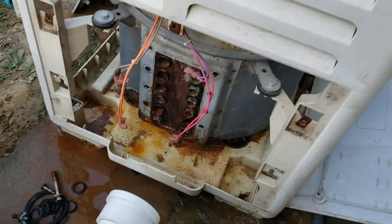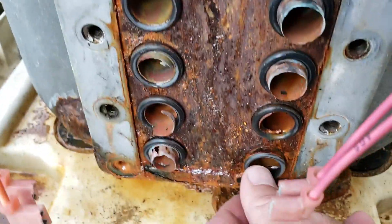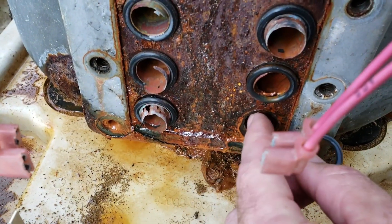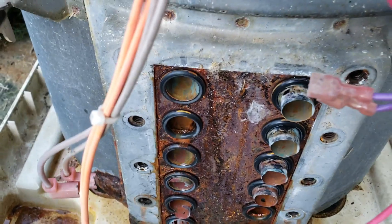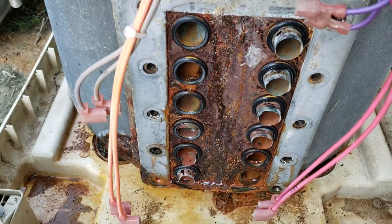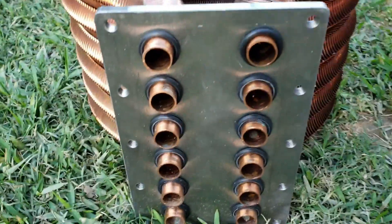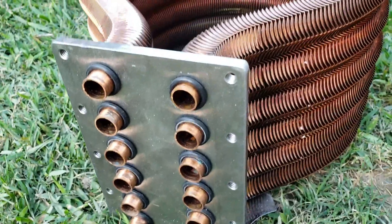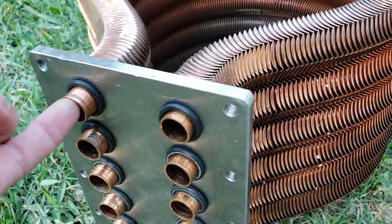Got the manifold off now and I just wanted to reveal why it was leaking. It's leaking around the O-ring here. There's no copper tubing for the O-rings to compress against. So I'm getting a leak that's filling up the tub, and this is what it should look like new — nice and clean and they are thick, about as thick as a penny.